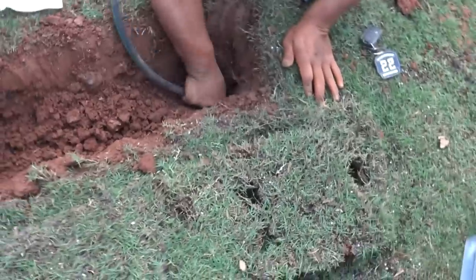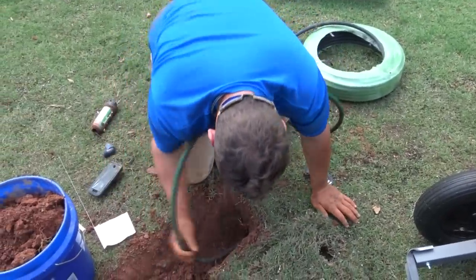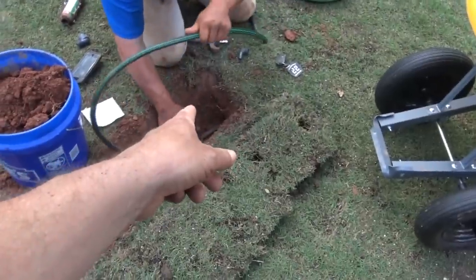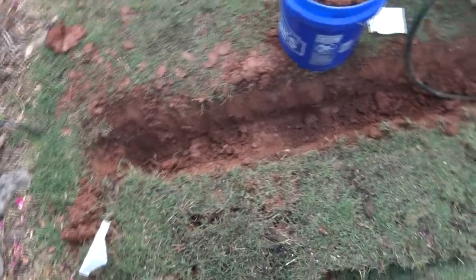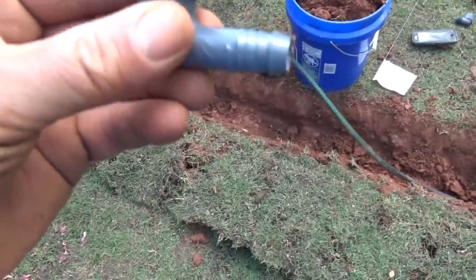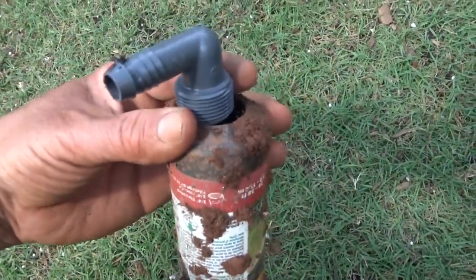He's joining that one into the other funny pipe that's already existing in the ground, so we know the funny pipe is running out here to a PVC tie-in somewhere. So old head here, run the funny pipe up, and we're going to move it here — it's a pretty simple process. Once he cuts it, this little piece is going to go into the elbow and into the funny pipe, and that's what the sprinkler head screws into. This one screws into the bottom of your sprinkler head, and then this piece goes into that funny pipe. That's how it works.